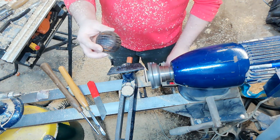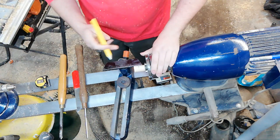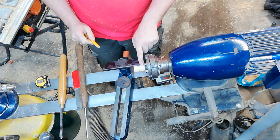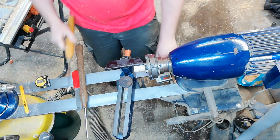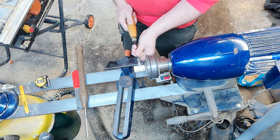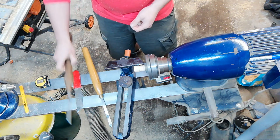Now marking out the Viking — we're going to go down 15 millimeters and put a little line, then rotate the lathe round. The bottom portion of the head is going to be 15mm as well, so you have to be quite careful as we get close to the jaws of the chuck. Turn the lathe on, and at that 15mm line we're going to feed the tool in about three millimeters. That's going to be the face, and we're going to do the helmet next.